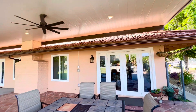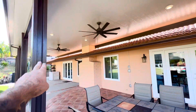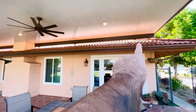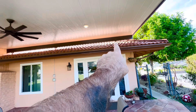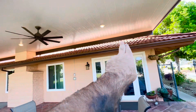Roof mount on tile — this is what we specialize in. I feel like we've done a couple hundred of these just on top with this tile. We have six brackets in here. You're going to see a header beam here with steel inside of it, and then we've got a bracket there painted brown to match the beam so you can't really tell. Another one here and here, so we've got that steel going across.